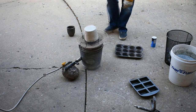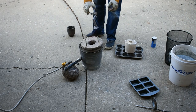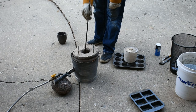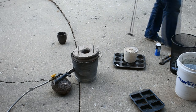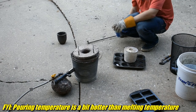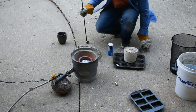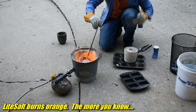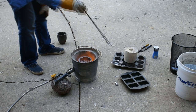I'm calling it. The aluminum inside the crucible is melting. Just want to stick that here. Time to start feeding in the metal. I think my last bit of aluminum is through the hole. I just want to let it get heated up a bit. I want to get that liquid heated up a bit, and then we will clean up and pour. I've got my flux here. This is going to be pretty toasty — probably should get a long-sleeved shirt. There we go — long-sleeved cotton shirt. Doesn't really protect me from much, but it does make me feel better. Add in my light salt flux.